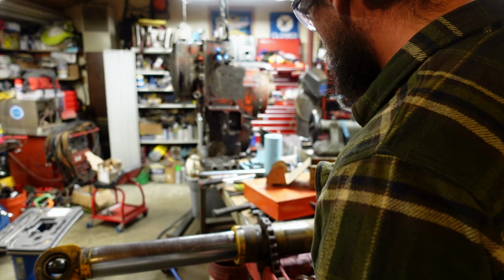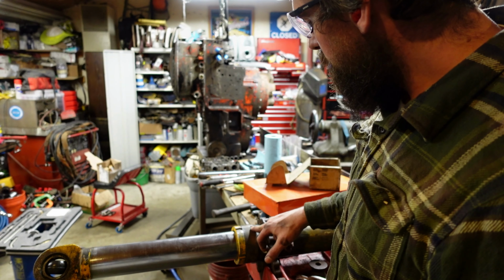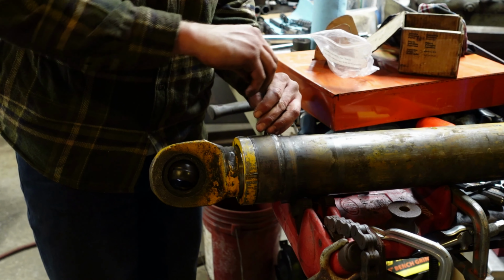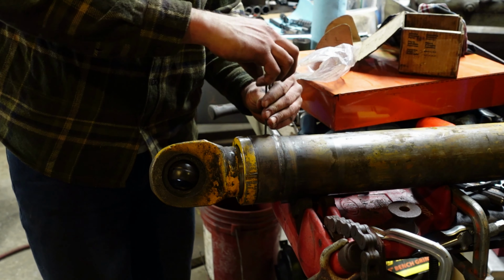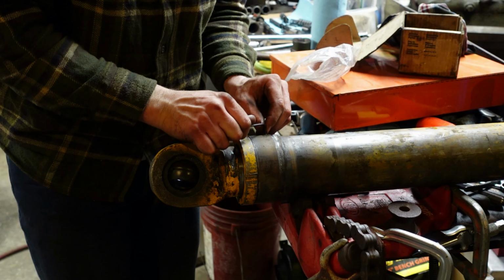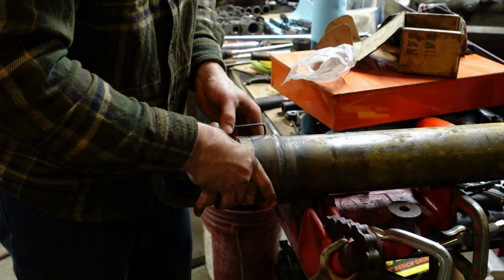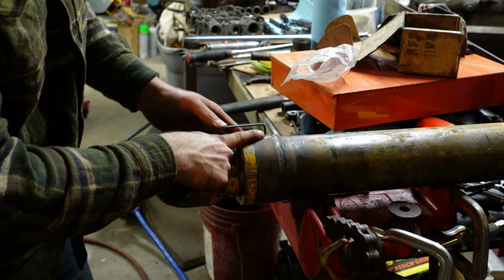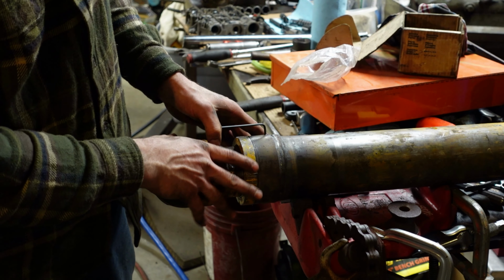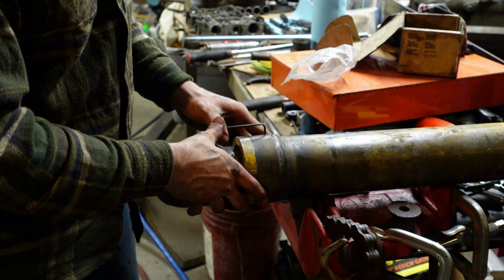We're pressure tested. The only thing we need, there's a set screw hole. This just keeps it from backing out. It goes in there, and it's behind the threads, so it can't spin its way out. So, key with the set screws, when you're taking them apart, they're usually covered in junk, because if you're taking them apart, you're replacing seals. If you're replacing seals, it's leaked, it's covered in junk.